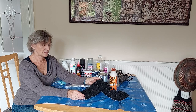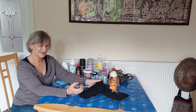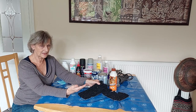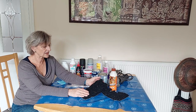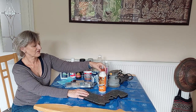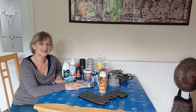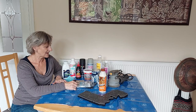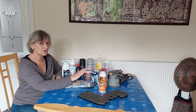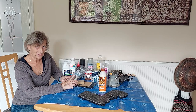The last thing I'm going to do — this is a piece of coir matting that I got from the bin of a local mat maker — and I want to put it on the bottom of the feet because the chair is wooden. It's old so it's probably quite porous even though it's going to have three coats of paint, and I'll put plenty on the bottom. I want to really protect it from any water that might get under there, so I'm going to cut this up and then glue it with Gorilla glue. All these materials have been sourced from my local high street in a small rural town in the east of England — mostly charity shops and cafes — but I've managed to get everything there. You can buy more professional, more expensive materials and equipment, but you will see as we do this chair that it isn't necessary.